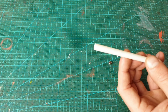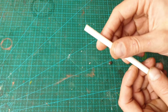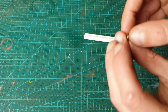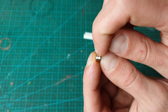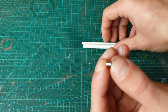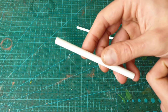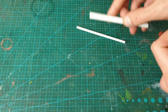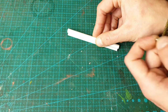What we're going to do to stop it rolling out - we're going to have one magnet at each end for positive and negative, and we'll mark it afterwards when we paint it. We're also going to cut a shorter tube that we can put inside. You want to measure how deep your magnets are. Mine are two millimeters deep, so I've cut a short stick at 100 millimeters and a larger stick at 104 millimeters - four millimeters longer, giving a two-millimeter gap each side, matching the magnet depth.